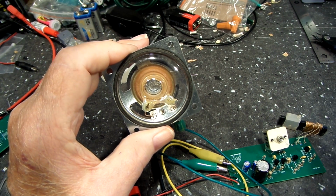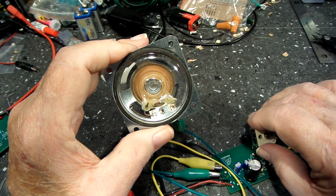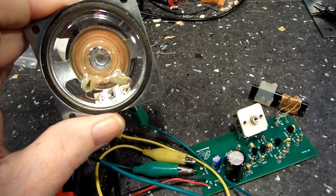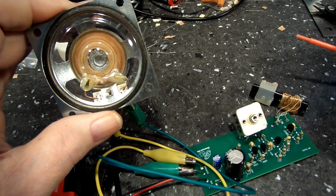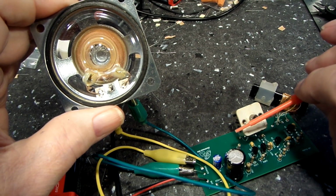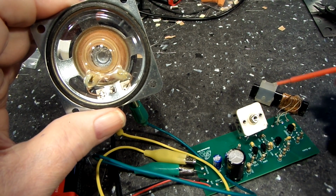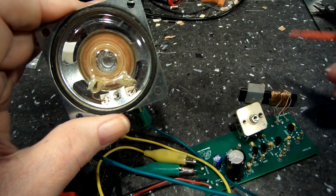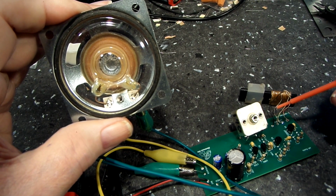Like I say, this is an old, and I say old, I don't know how old it is, but it's an old transistor radio. I'll get you down here so you can see it. The loop stick and the V-cap are both from an old transistor radio. You can see, I don't know how we can see it, but I've marked 140 on this side, because that's this side of the capacitor, and the other side's the oscillator, 60. It took me a little while to figure out the wiring of the loop stick, because I thought it would be these two.